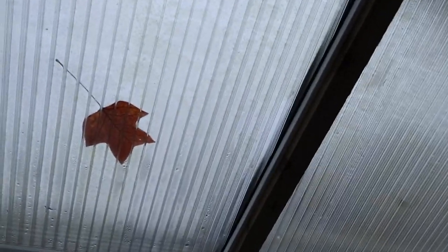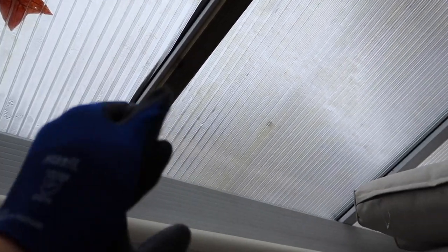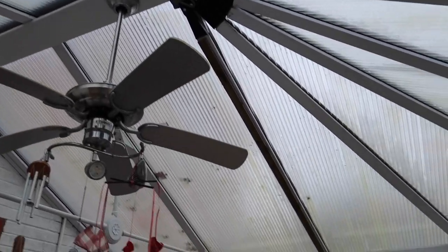I've got my first two pieces of wood on with three screws in each. I did opposites first, since if one length is measured the opposite one is the same. I drilled a pilot hole in the wood first with a smaller drill bit, partly placed the screws, then offered it up to the ceiling and drove them in with the electric screwdriver. It is hard work — once you get into the metal they go quickly, but it's hard getting them to grab initially.